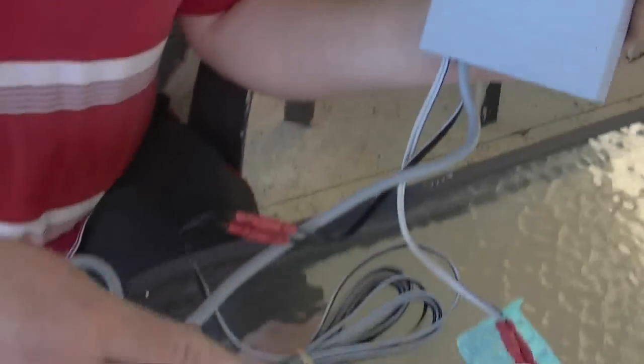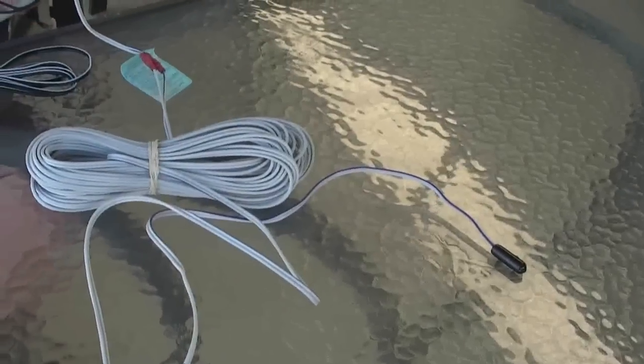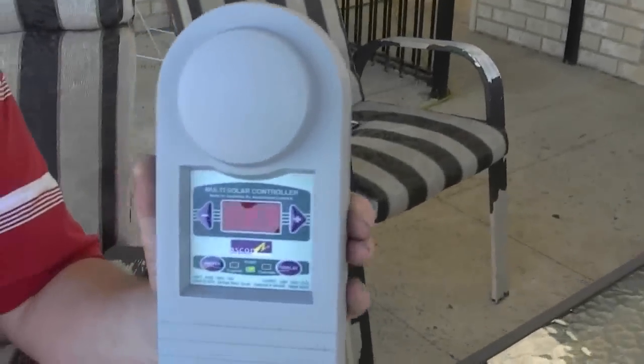You've got two sensors with this unit. One sits in the suction line reading your pool temperature, the other one sits up on the roof in the sun or on a fence somewhere in the sun, just to get the ambient temperature or the temperature in the sun. You need seven degrees warmer in the sun than the pool temperature for it to be worth coming on. As soon as you get that differential, she'll click on and run until it reaches what you've set it for, or you lose the heat on the roof — so if it's pelting down with rain, it won't come on and work for nothing.